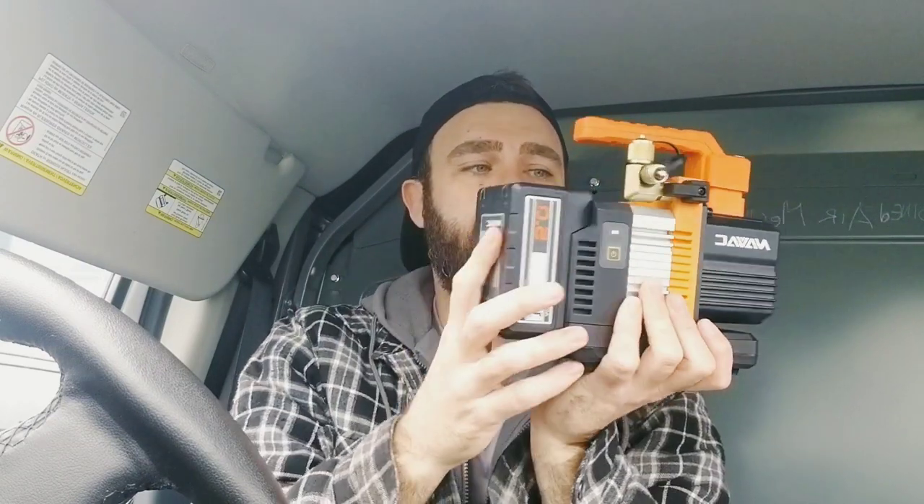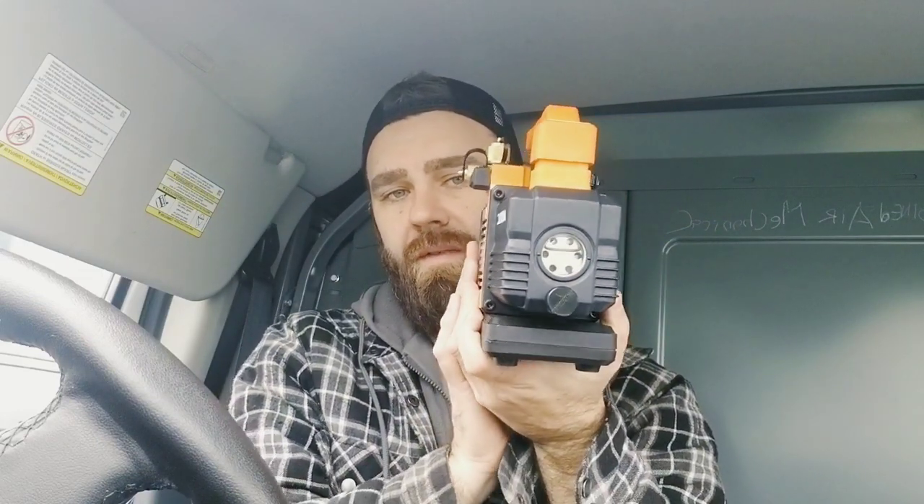I don't mean lose it, but the power dies in the battery while you're using it. Well, it's got a built-in check valve that keeps your evacuation in the system at bay. It's got a blank-off here that you can use as well. It's got a cap here where the oil gets filled, and on the back it's got a very large sight glass so you can see your oil level now.